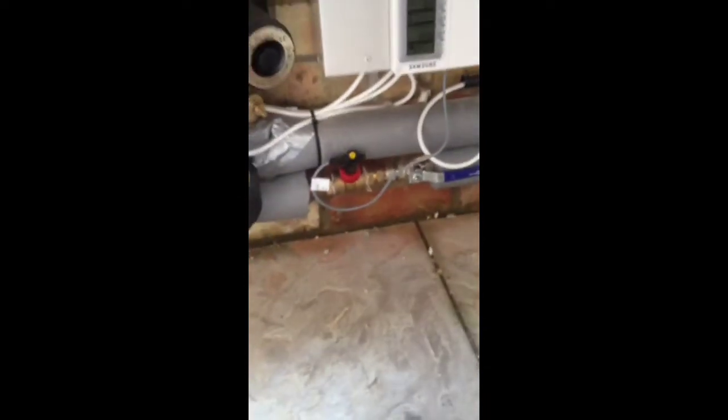On the 16kW I think it's 30 litres a minute. What some manufacturers are actually doing — or you can buy one yourself, it's not very hard at all — is you can now get a flow gauge. You'll actually see just where my thumb is: you've got 30 litres a minute there, 20 litres a minute there, so we're on about 25 litres a minute — we're absolutely flying through. But basically if this doesn't read 20 litres a minute, that flow switch generally won't make, and this is why you're getting an E911 fault.